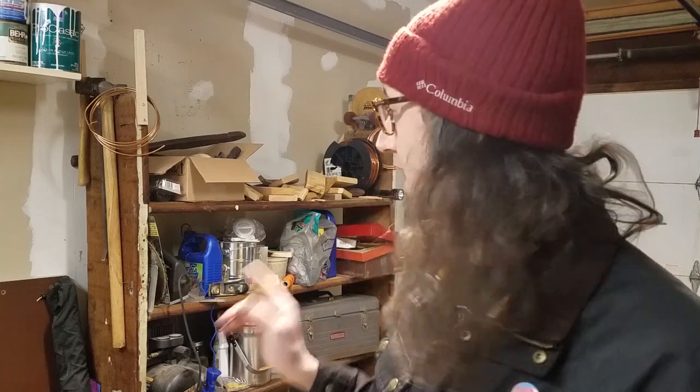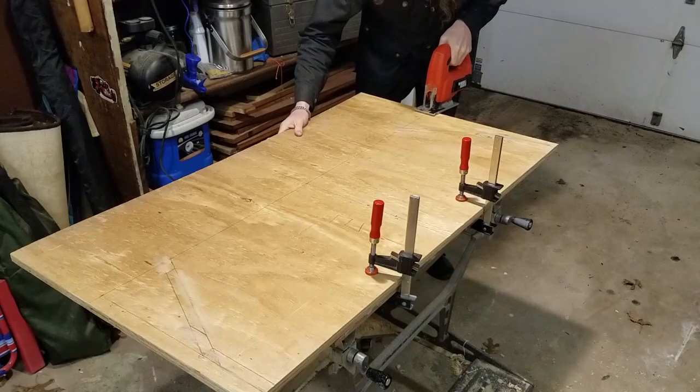If you're not making furniture or you're making like boat type stuff, a block plane will take you really far as long as you're not Steve and trying to like hog down, you know, giant pieces of centerline timber. You're making a little dink like this, get a block plane.